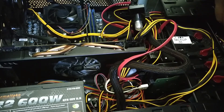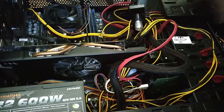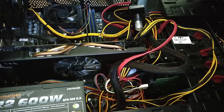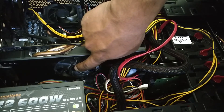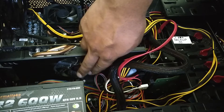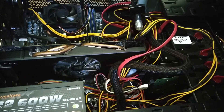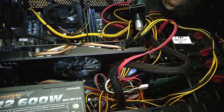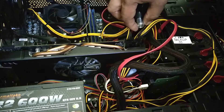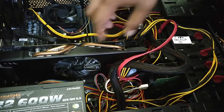The solution was to make the fan run. These are four-pin fans, and if you just connect 12 volts and ground, the fan runs at maximum speed — which is not what we want. I wanted to change the speed using a knob. So I'm using an ATtiny85 connected to a potentiometer, and as I rotate the knob the fan speed changes.